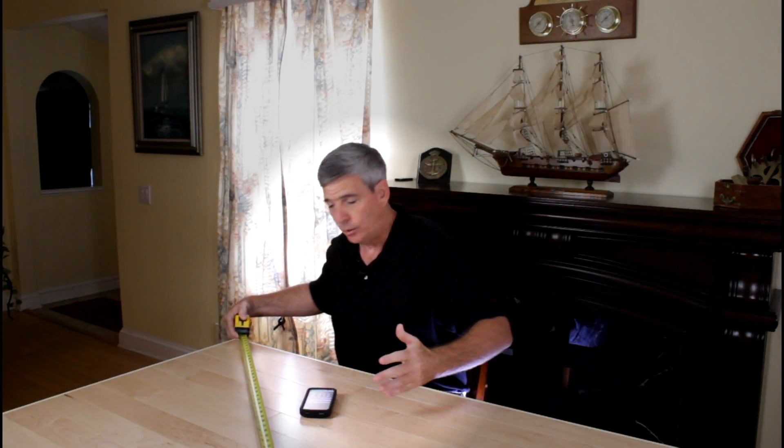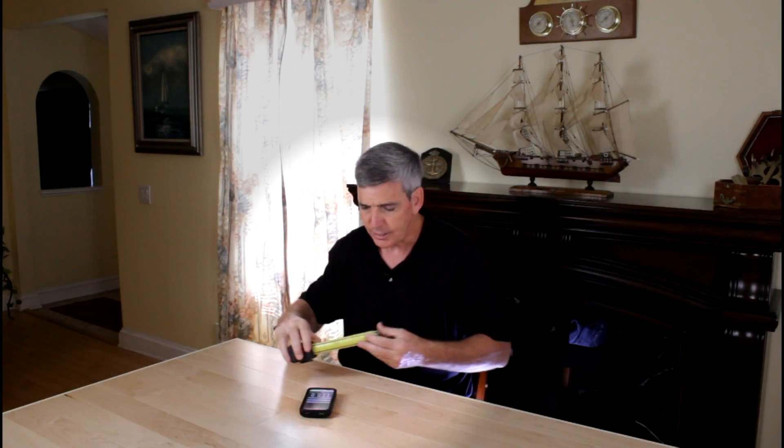If not, we're going to rack the piece until we hit 63 and a half inches, then double-check by going to the other two corners to see if that's also 63 and a half. It's a great little tip — it'll make sure that all your bookcases, walls, and decks are square for you. I'll catch you on the next one.